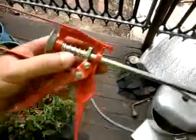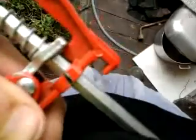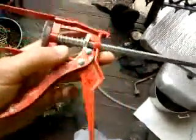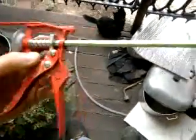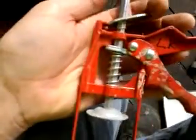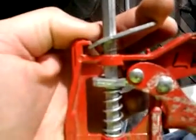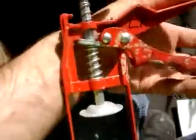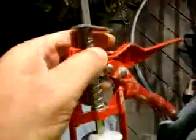Alrighty, well, this has made its use by date. I noticed it was kinking up all the time, and yeah, it's a casting, isn't it? That little piece in the end here, with a few bits riveted in, or however they do it. That piece there is supposed to be in there and stop you from coming back. I'll show you how it's done when it wants to move. Effectively that goes underneath there when it wants to play ball. Like that. It usually looks a bit more like about that far up with that stuck out like that. That stops it from going back until, of course, you push that in, and that's the one that works it forwards as you pump the handle. But it's got to have that one to work in conjunction to stop it from going backwards as it's pushing it forwards.